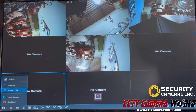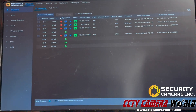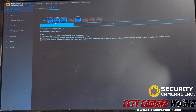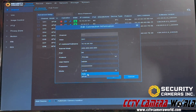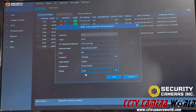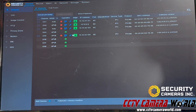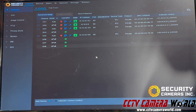All you need to do is go to menu Setup, go to Channel, click on the caret, change everything to EPOE, and wait a few minutes for it to connect. You can inspect the POE power output to see if your cameras are receiving power and how much. If you want to do some cleanup, you can go in manually and set channels that don't need EPOE back to regular auto — but that's not necessary.